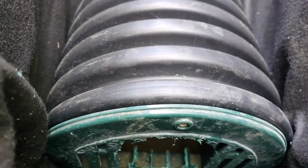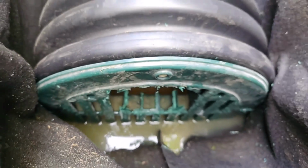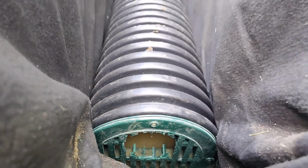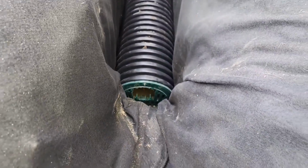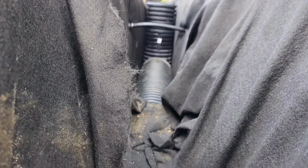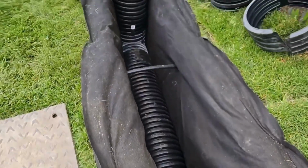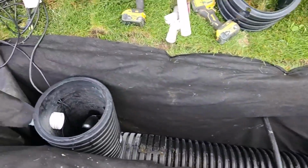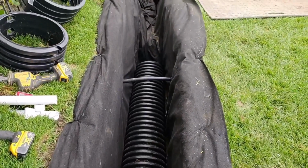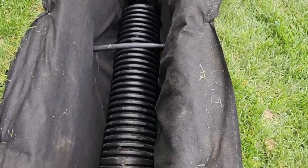Your sump pump pit has to be 12 inches deeper than your French drain trench. Now the men took a 5-inch hole saw, and they knocked out the top of that grate. We're going to hook a solid pipe right there that has catch basins on it. The reason why you want your sump pump basin 12 inches below the bottom of your French drain trench is because it takes 10 inches of water to turn on your outdoor sump pump. And it's sitting in a basin that has it lifted off the ground 1.5 inches.